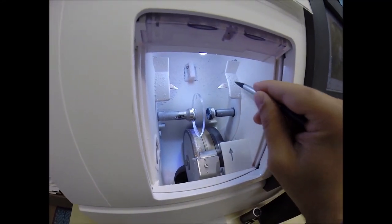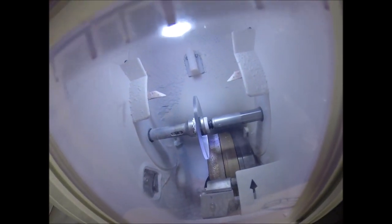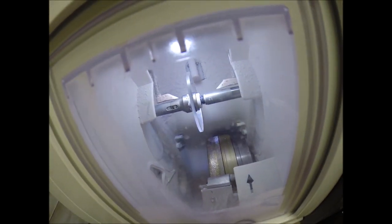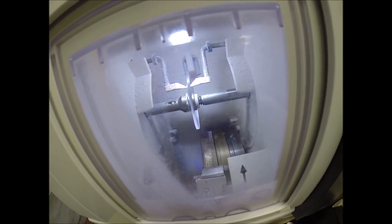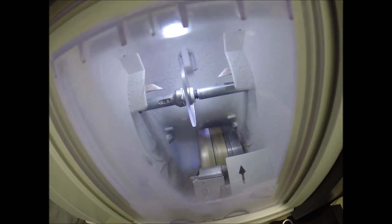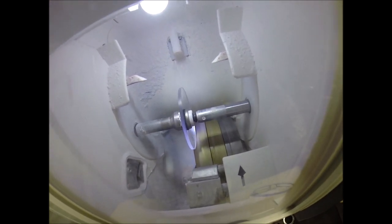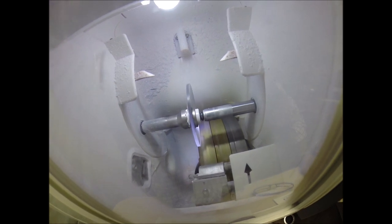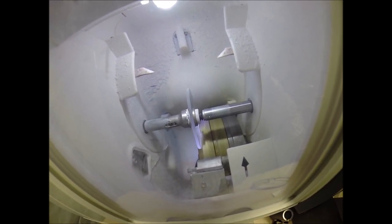I'm going to hit the green arrow, which is start in every language. The door closes, the clamp shuts. The lens is going to be traced by the two white styluses, making sure it's large enough to fit into the frame. You can see it going around tracing the shape now. The old carpenter says measure twice, cut once — it's measuring the thickness of the lens at every point to know exactly where to place the bevel for the least amount of edge thickness. If you see light flickering in the background, that is water there to catch the optical sawdust. Polycarbonate lenses cut dry, where plastic, high-index plastic, and Trivex lenses cut wet. Water will spray onto the lens for the last 20 seconds of the cutting cycle to wash away any optical debris.